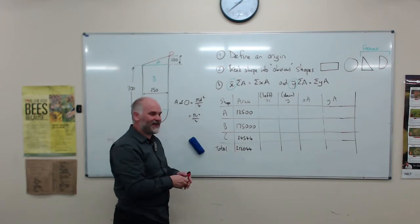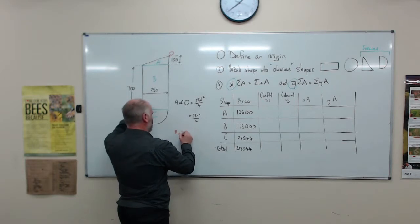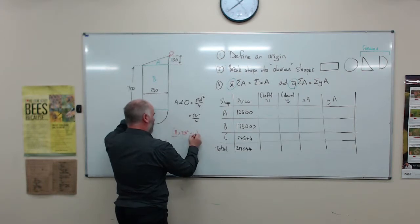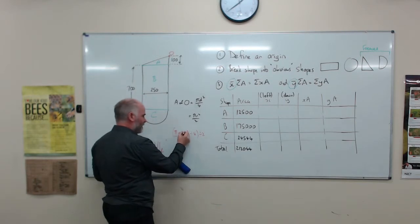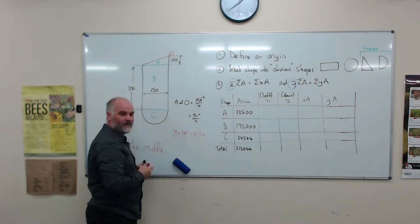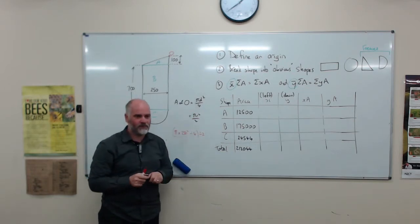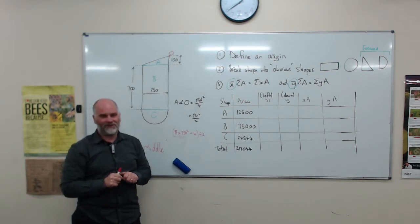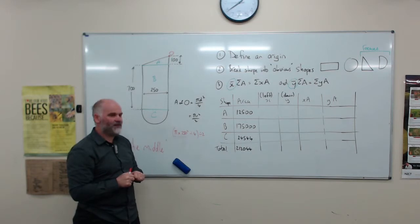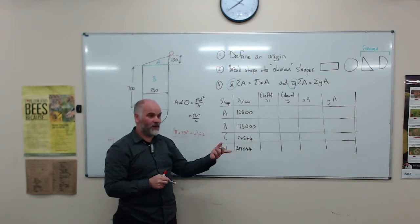So Shane, okay, what we should be doing here is pi times D, 250 squared, all of that divided by 4, and all of that divided by 2, because it's a semicircle. Try that and see what you come up with. Okay, so that's just the formula, and then divide by 2, because it's only half a circle. And then 43.7, round up, yeah, okay.